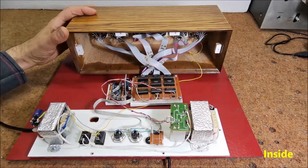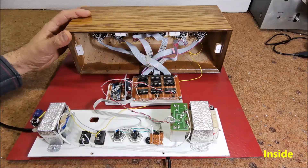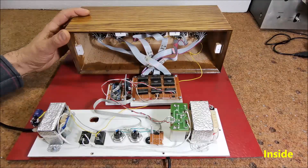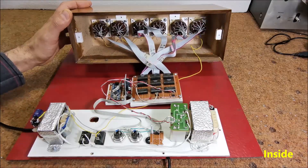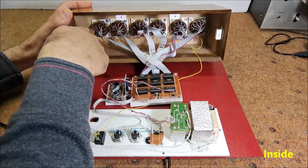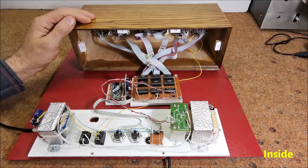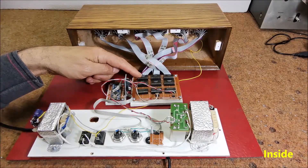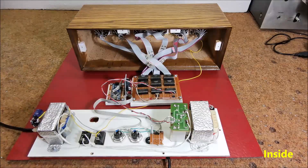The device is relatively simple to build due to the use of an Arduino Nano microcontroller, given that such clocks are typically dominated by discrete electronic elements and are complex for homemade enthusiasts. It consists of the following components: 6 Nixie tubes IN1, 6 integrated circuit drivers for Nixie tubes type K155 or SN74141.